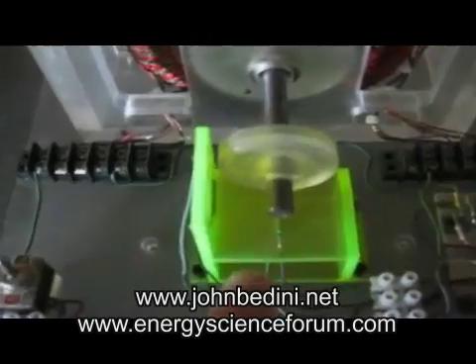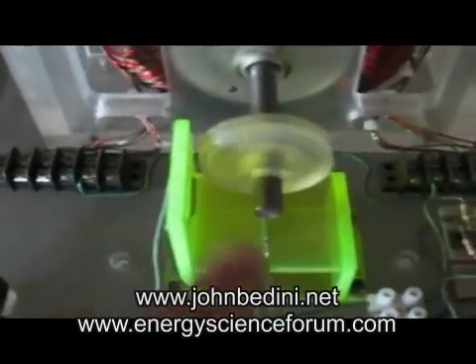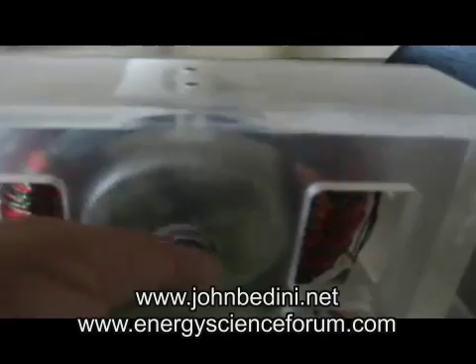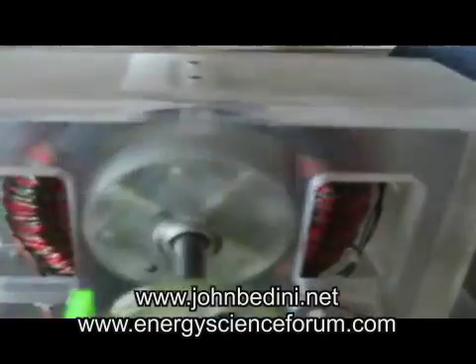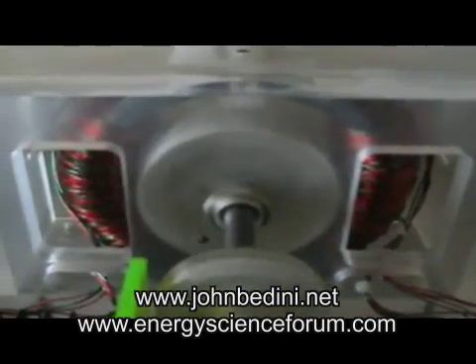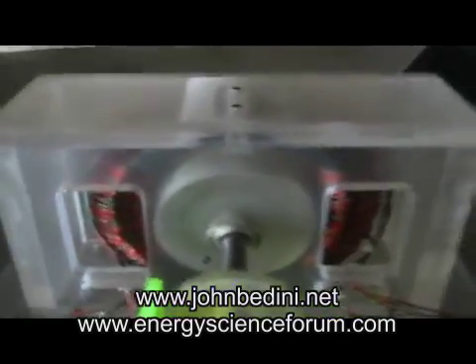The circuit — the switching is done with reeds. Peter decided to do it with reeds, and it's done at every 90 degrees. And it's a NEO magnet setup. Inside the rotor are four NEO magnets. And then see it moves up, and when you hit it, it self-starts. So thanks for watching.